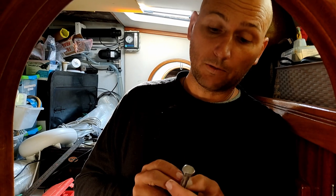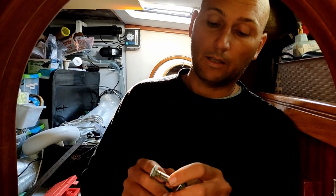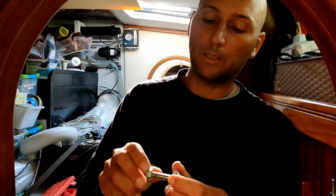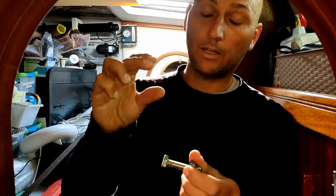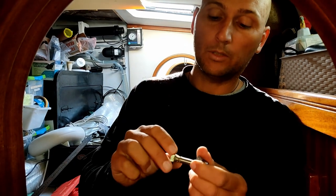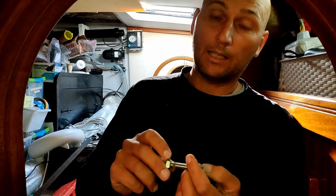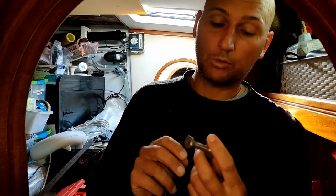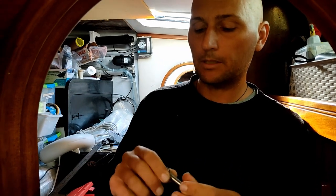I'm going to check to see if I can get some fully shanked A80 grades. If I can't, I'll check whether fully shanked A70 grades will match unshanked A80 grades. By having an unshanked bolt, particularly in the area most in shear where the chain plate is, there's actually only 8mm in diameter, not 10mm — because the outside of the thread is 10mm but the inside solid bolt is 8mm or just under. So I'm going to do some quick shear calc checks.